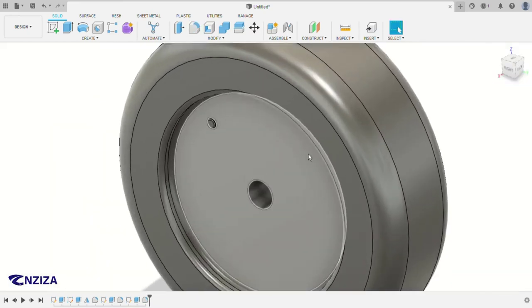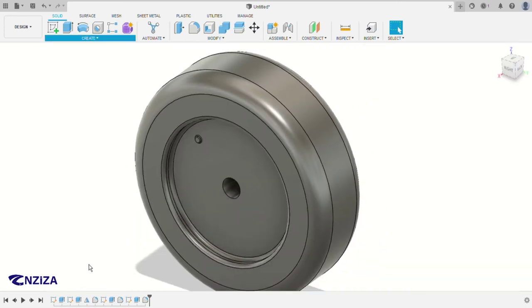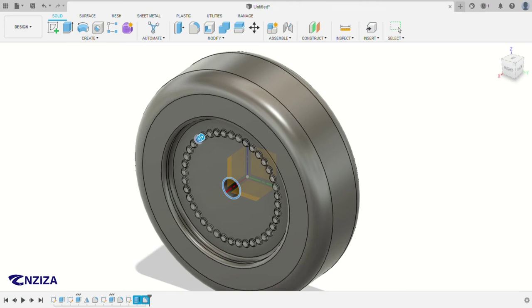we want to make a circular pattern from the whole of this feature. So we're going to go here, pattern, the circular pattern, then bodies with features, and then we're going to use this feature and then the fillets as well, and then the axis will be any circle that you can come around that revolves around the features. So we're going to use the quantity, which is 40. Okay. Oh no, I mean 20.